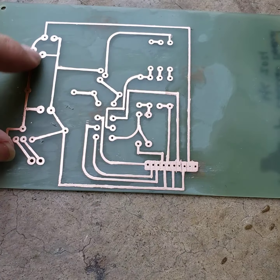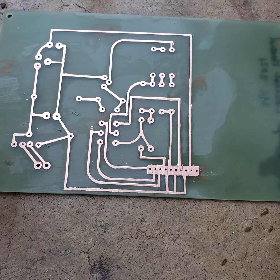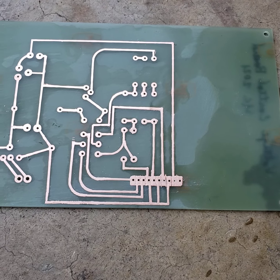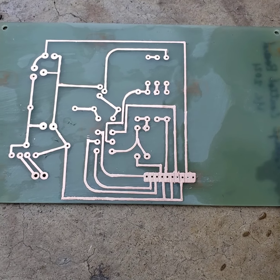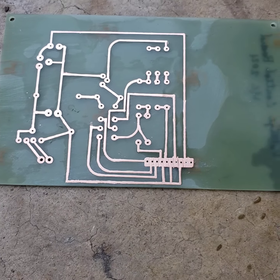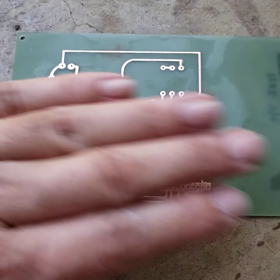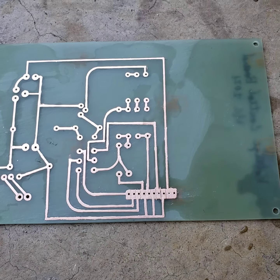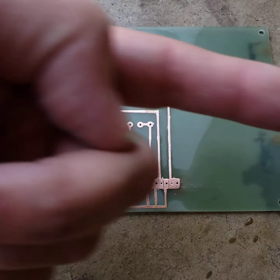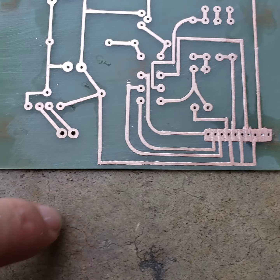You want some surface roughness for the paint to stick to. If it's too smooth the paint's just going to chip off. Honestly, 400-grit is probably not aggressive enough for the paint to really bite into, because when I sand I only go in one direction — that's good for lines perpendicular to it, but it's very smooth going in the grain direction. You want something that's somewhat aggressive.